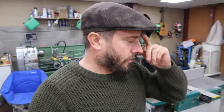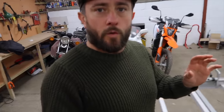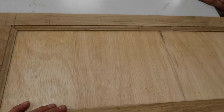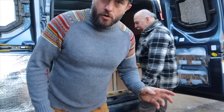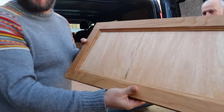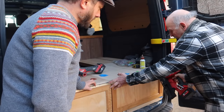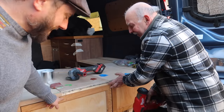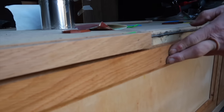After that oak-faced veneer being a bit temperamental, we're not going to go with the oak-faced ply because we'd have to order it in. So we're just going to go with some plywood. This is the finished result using those router bits. There's another one to knock up — I look to my left and he's already done one. So you've seen the wood being routed, seen them being put together, and I've had a bit of Danish oil on — look at that. At the back we've doubled up on the plywood so it's flush with the actual drawer itself. And of course these will get stained the same with the Danish oil.